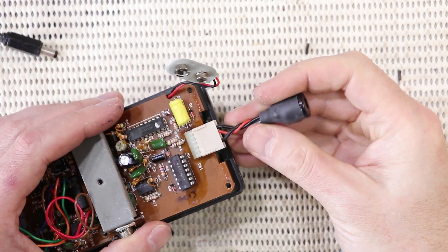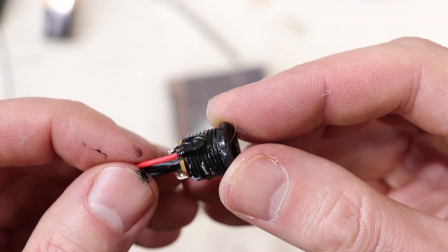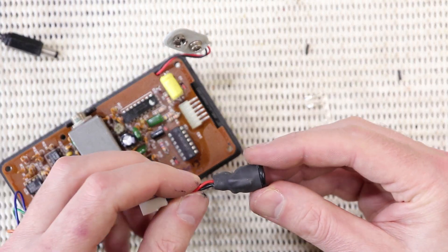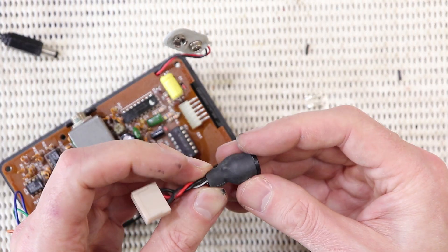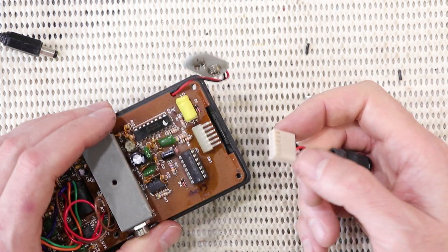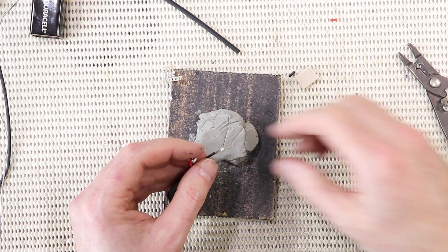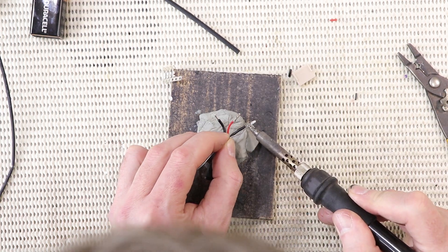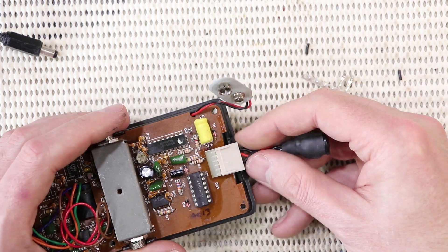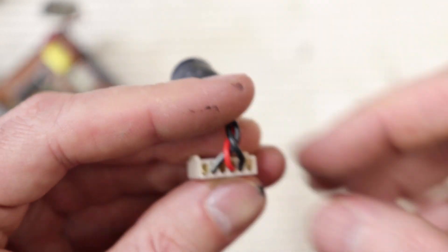So there's my little adapter gadget. I've actually glued two of the wires to the sides of the body of this jack, and I also used some heat shrink that's lined with hot glue for strain relief and ruggedness. I also used a bit of contact cleaner on these connectors — let's face it, they're close to 40 years old. I crimped them as best I could with my needle nose pliers and then floated a little solder in there as well, so they should be okay.